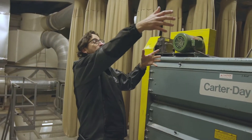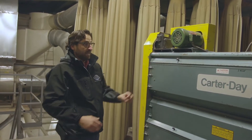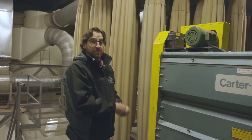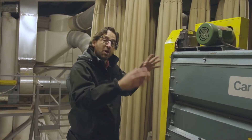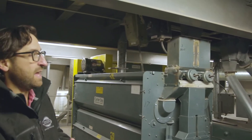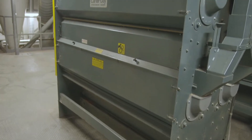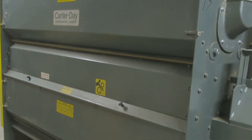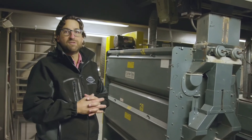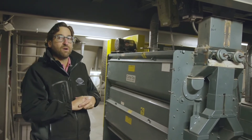We have flats coming up this leg into the sizing machine — the first sizer — which sizes our large flats and large rounds on the third floor. Any seed that doesn't fall through these holes goes into the large bins on the first floor, and anything that falls through the screens goes to the next floor to hit another set of sizers. We have another series of sizing equipment that takes corn from the third floor to the second floor. We often size four sizes — two flats and two rounds — but we also size in many other ways and adjust these sizing screens and flow path depending on what sizes we want to make.